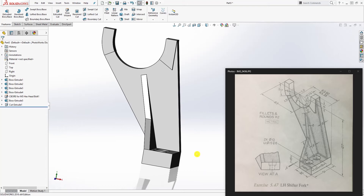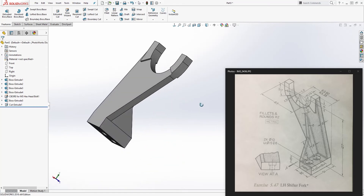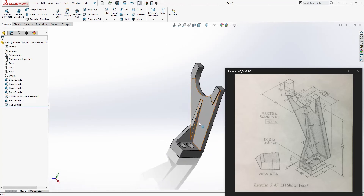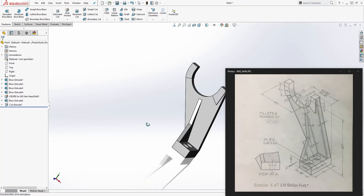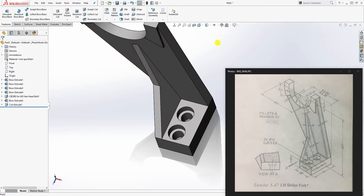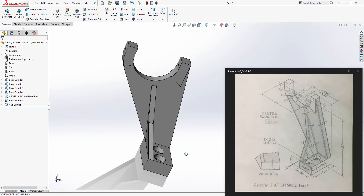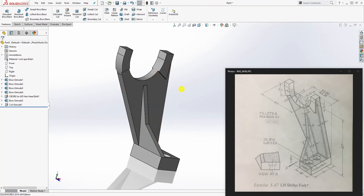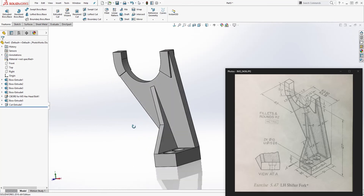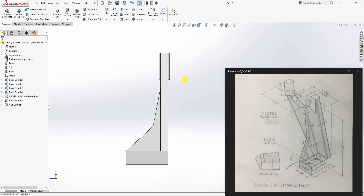The part is done. It did take me a while to add the fillets, but you can add them all in. Go around and add fillets — the fillet size is 2mm. Sometimes you may have to add them one by one or rearrange them, but they will fit. I just wanted to show you the basic way of making this part. Thank you — if you have any comments, suggestions, or another way I could have made this, please let me know. See you in the next tutorial, bye!